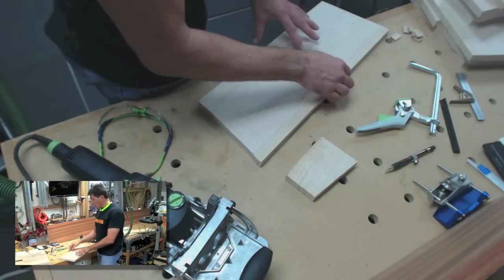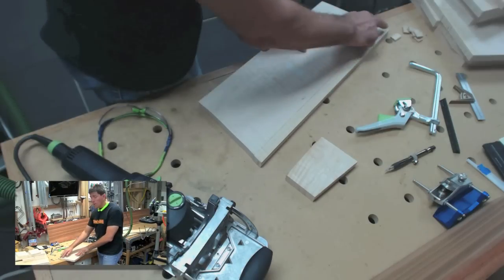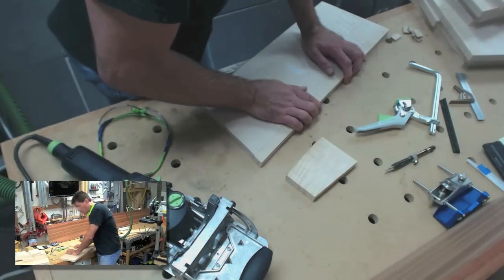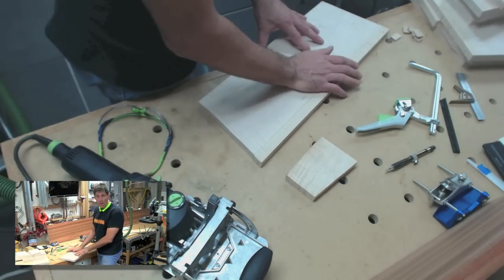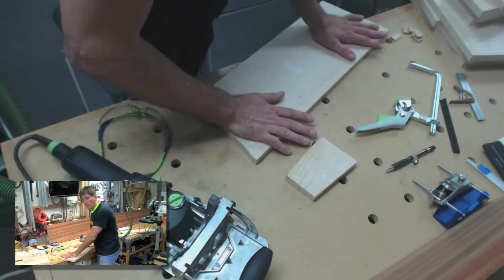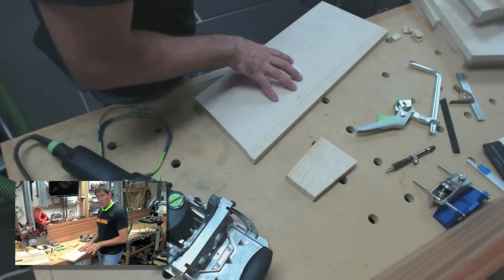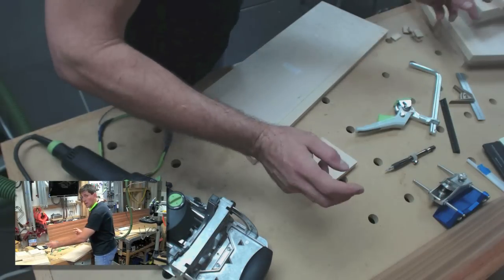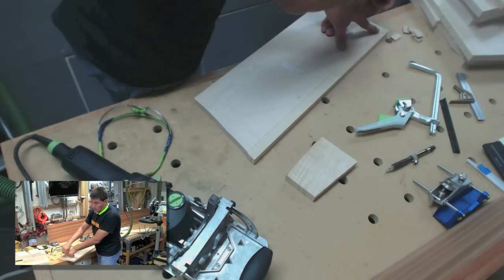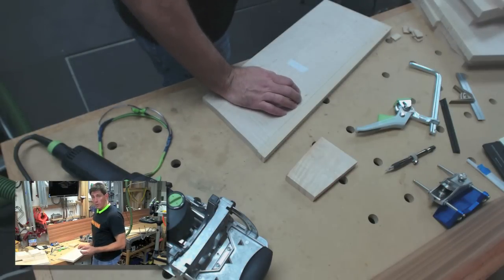So what I'm going to be doing is leaving the dominoes in there. Those are to hold it and keep it nice and secured. I'm going to put a strip of packing tape all the way along here to make sure that this thing stays together nice and tight. There's no bowing. It's not going to affect anything when we go to do the cuts, but just to make sure that this stays exactly in place. Then later on, when we need to actually cut the drawer parts out, we're going to separate that, cut the parts, and then glue it back in. But we're going to have a very clean miter cut there so we can use that for the alignment. All right, so I'm going to go ahead and put the mortises in the rest of them.